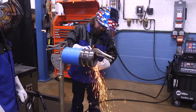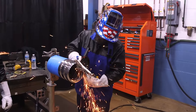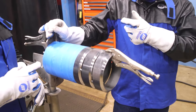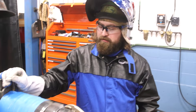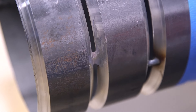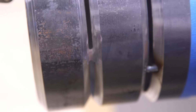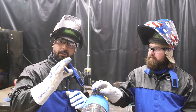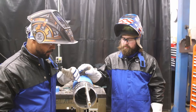Dakota here just feathered his tack, so make sure that you feather it nice and thin — starts and stops too. One thing that we like to do is make sure that when you've feathered it, it's thin enough. I like to see that bluish color right at the start — that's a good sign that you're doing a pretty good job on your feathering.